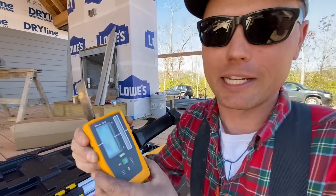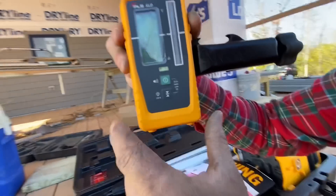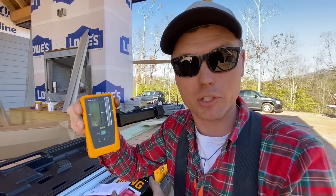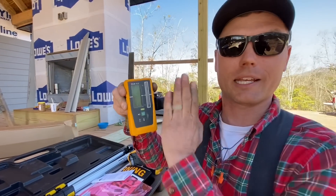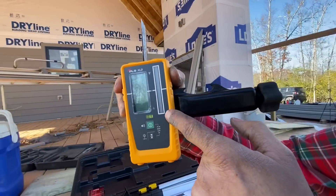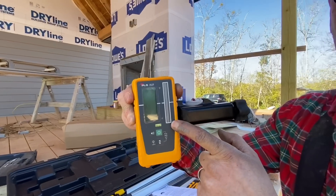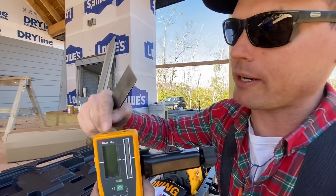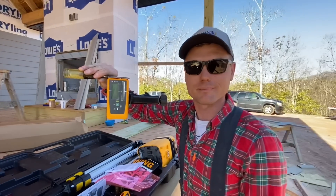Let's check out this reader. It's got a little bubble level in there so that when you're holding it on the stick you know you're holding the stick vertically — because as you lean, you'll read a taller measurement than it actually is, and when it's vertical you get an accurate measurement. Next, there's this large reader scale — it has a higher range than any reader I've had before. This thing is dustproof, water immersible, and it's got rare-earth magnets so you can mount it to anything steel.